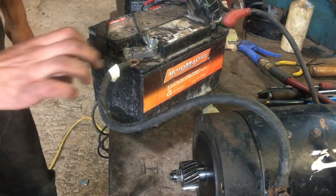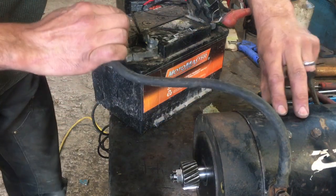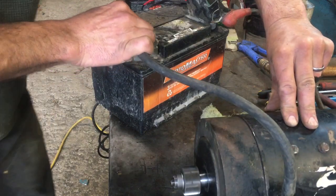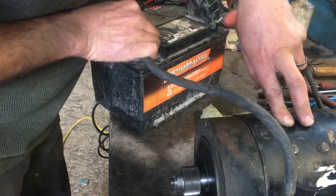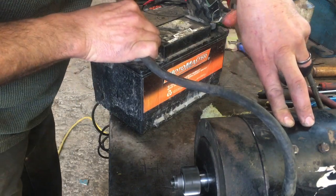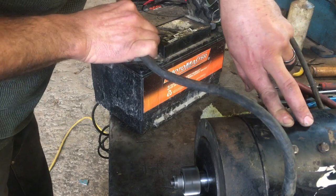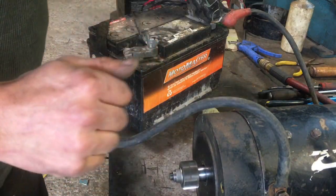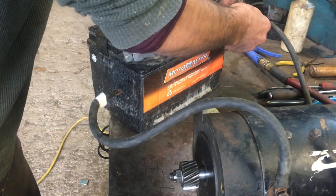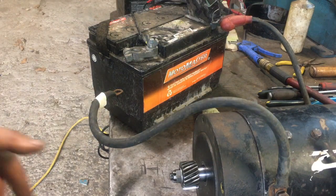Found a crappy 12-volt battery that's dead enough that it's barely working, but I'm charging it at the same time. Motor spins up — brushes are quiet, granted this is low voltage, but running very smoothly. I'm happy with that. I'm probably only going to run it at 24 volts in the application I'm designing, so that's half speed and that's lovely. Motor can go back into service.